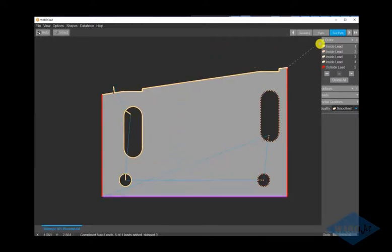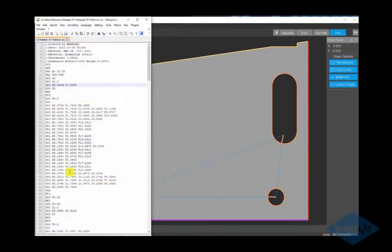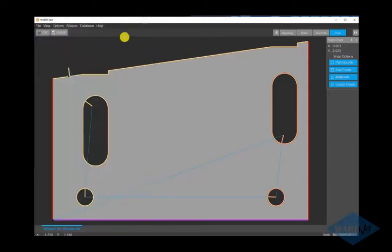So we've got our tool path, top right hand corner, hit your next button, top left hand corner, click on the CNC button to create our CNC file. If you want to, you can have this preview open up here that shows the code that we run. We do run standard G code, so things like G01 for straight line, G03 for an arc. If you don't care about seeing that code, that's an option. You can just turn that off.